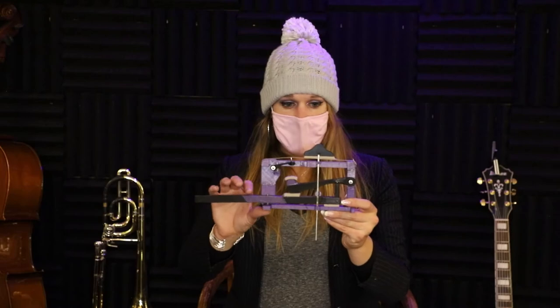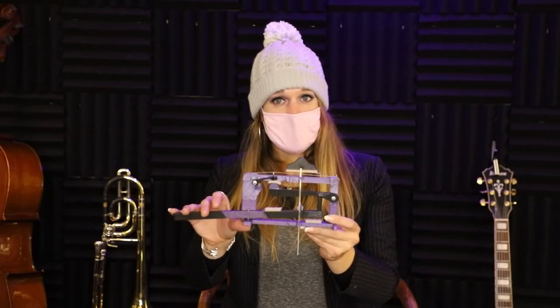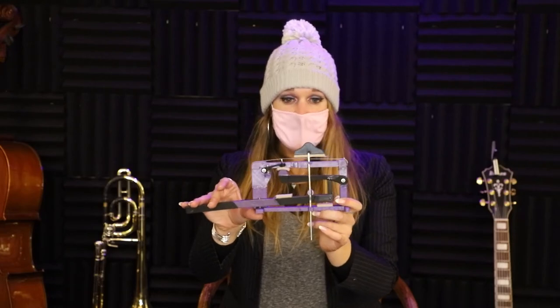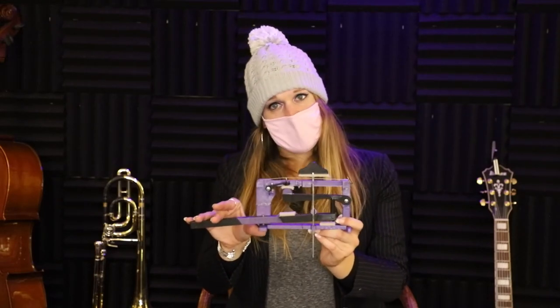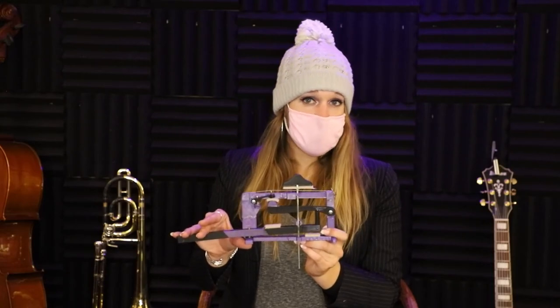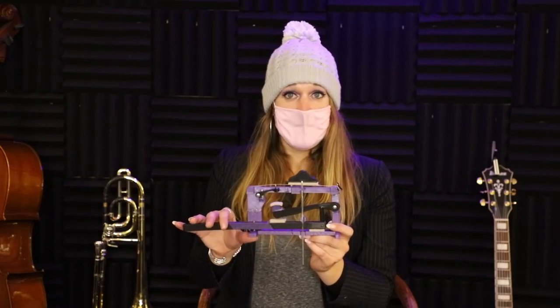If we look at this design, you can see all of the parts are working as intended. When the key is pressed, the linkage raises the hammer, causing it to strike the tangent arm. The tangent arm then transfers most of that kinetic energy into the string, resulting in vibration. The string isn't dampened because the damper has been raised by the damper guide. Now the sound is very weak and not particularly clean, as the string is only about 10 centimeters long, there is no soundboard, and I only have plastic parts so I couldn't tighten it particularly taut. But it demonstrates that it's an effective mechanism, and it works — the proof of concept is a success. I can't pick it up on the microphone particularly well, but you can audibly hear the string vibrating, which means on a better designed full model it will actually produce a tone.